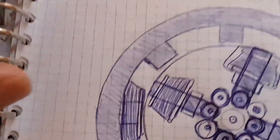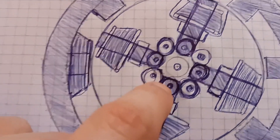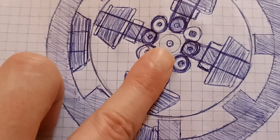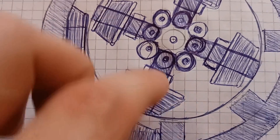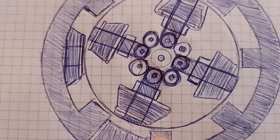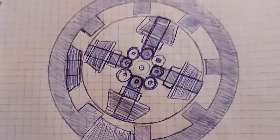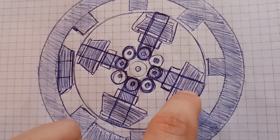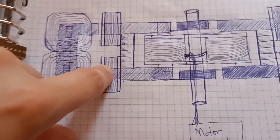These operate in two phases — I've drawn it in the motor phase, just about when the motor is going to stop. Because it's in attraction, it will attract inward, then let loose and slap back, and because it's rotating it will start to attract to the generator. Now you start thinking about where to put the coils for generating power. I've drawn an example of how the coils could be on the rotor — eight coils, because you have an upper and lower half of the generator motor.